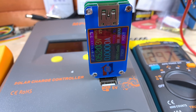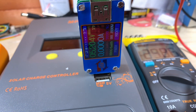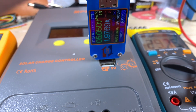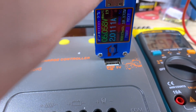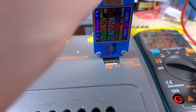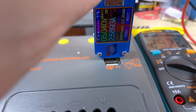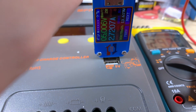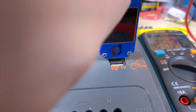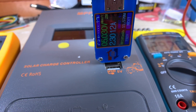While watching the batteries charge, I tested the USB output with my Rui Deng meter. It's producing 5.2 volts, and with a load plugged in, it sat at 2 amps. Increasing the load, it was still producing 5 volts at 2.5 amps — sat there quite nicely. It went up to 2.7 amps at 5 volts before cutting off, so about 2.7 amps maximum available from the USB ports.